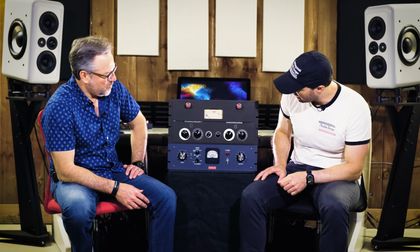And a lot of times, like I said, we made life harder with that balancing procedure because we're supercharging the tubes now and using negative feedback. We have faster release, all that. So all that plays into the balancing. If the device is even just the slightest bit out of balance, these two tubes will notice that. So that's something we have to look out for. One of the many challenges in building this, aside from the multi-part process of the separate chassis that goes inside the case and things like that.